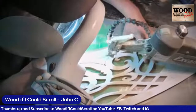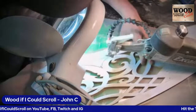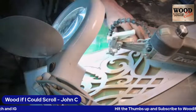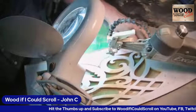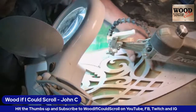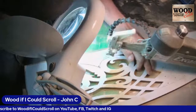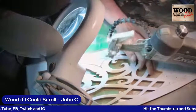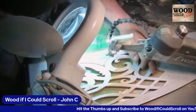Dave Weber says, what blade are you using, John? I started off with an 01. I changed to an 03 because it's actually more aggressive, and I find I'm getting a better cut out of this because it's half inch thick MDF. It's a pretty big piece I'm cutting out too. They're not like small, intricate, detailed pieces that I usually cut.